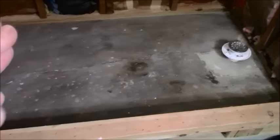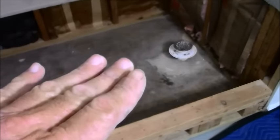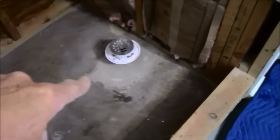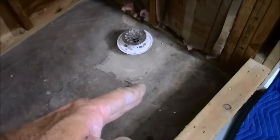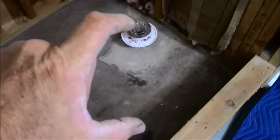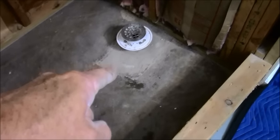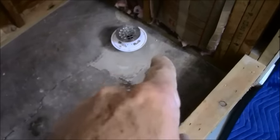I'm going to go backwards a little bit in time. This is actually a basement where they had done the rough-in. You see where that box was. Anytime you have a tub, there's going to be a boxed-in area where they pour the slab when doing the new construction, and they have some plywood inside of here, or it might be some 1x6 or 1x8 or whatever. So they build out a little box. This one's a little shorter than normal, but basically when you take out that box, you're looking at dirt, and the P-trap is under all that dirt.